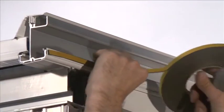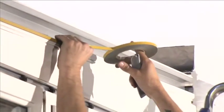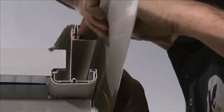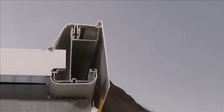Apply the 2mm glazing tape on the outside of the starter bar bottom cap and peel back 100mm of the protective film. Position the hook at the top of the fascia trim over the upright leg on the starter bar, ensuring that the inside face of the fascia trim does not make contact with the adhesive tape.